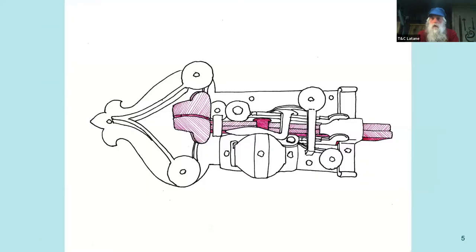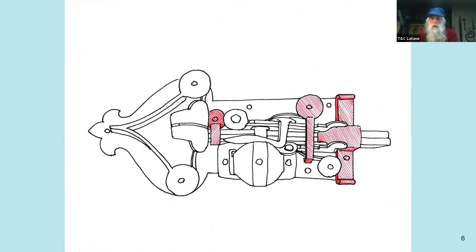One of the photographs of the lock has been traced and different elements marked in red. Highlighted here is the bolt, and the dark red item in the center is the talon fastened to the upper bolt that reaches down into the ward box below, so the key strikes it to draw the bolt back. There's another talon on the lower bolt, not visible in photographs because it's behind too many parts, but the key would strike both talons simultaneously to draw the bolts back.